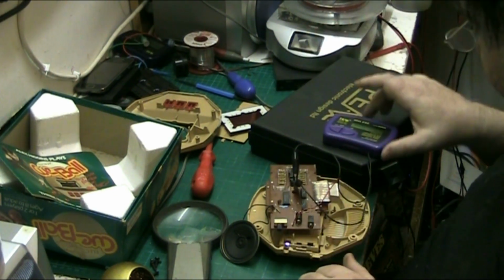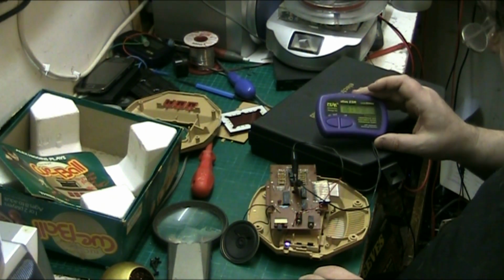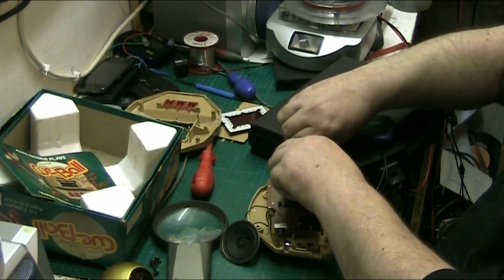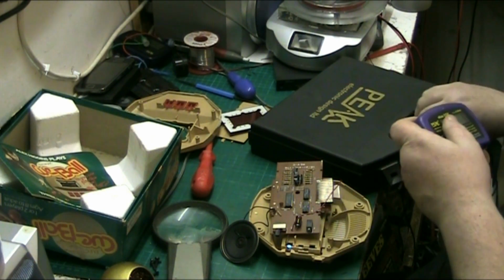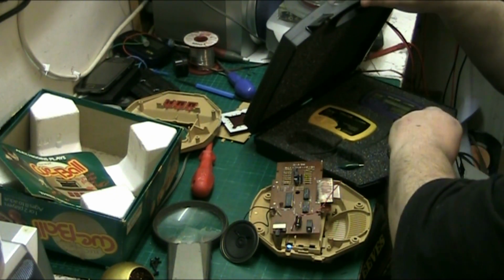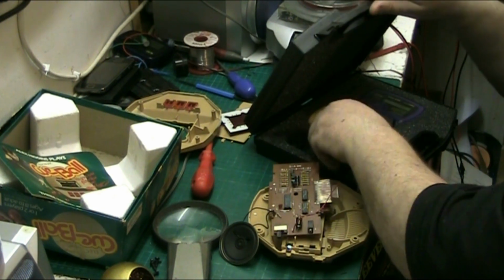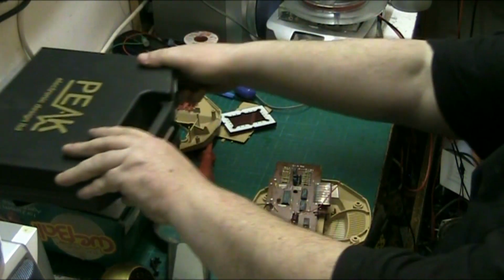And this one, 0.84, oh, that's the ESR, that's 10 ohms. Yeah, we'll replace that. We'll replace the capacitors in it, folks. And the reason why we'll do that is it'll future proof it. I mean, 10.6 ohms, that's a lot. But we will test them again once we've got them out of the board. We'll put that on there for a minute.